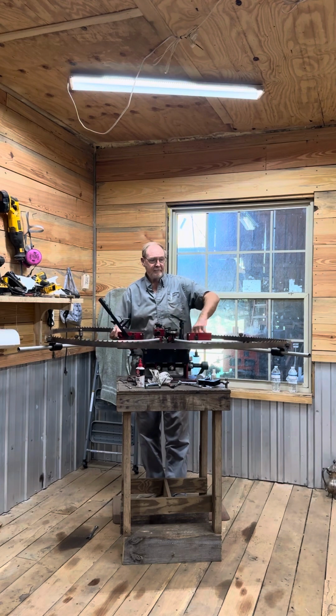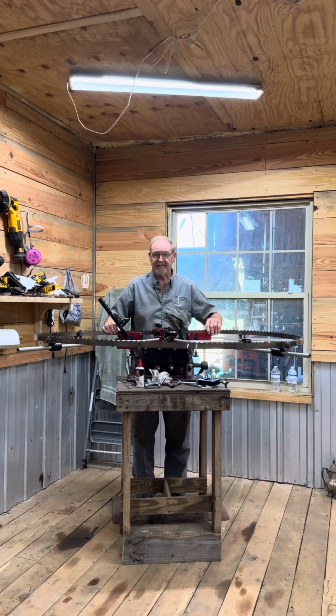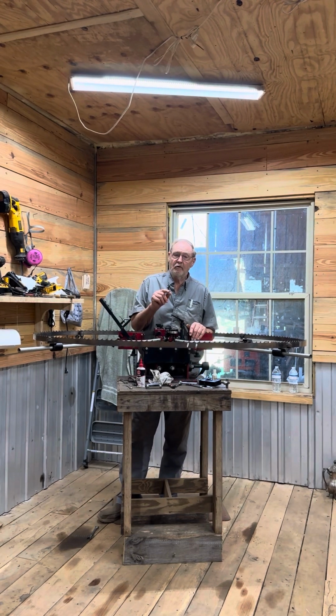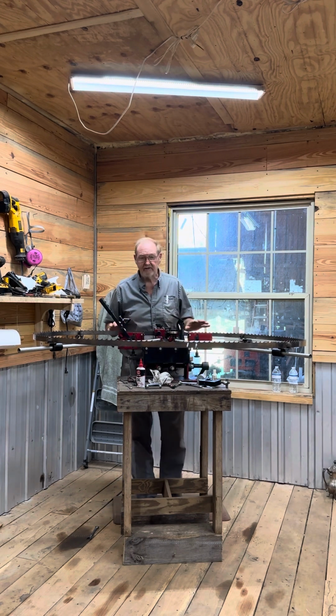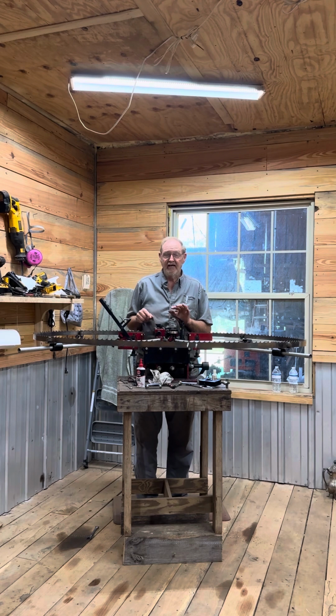and I put the weld joint 180 degrees out from me. I do not start my set at the weld joint. A couple of reasons: whenever that blade is welded together and you grind that off, it's annealed, it's heat treated, so the weld won't break. And for about this far on each side of that weld, that blade is hard, and the teeth don't set just right sometimes. So I like to start around here and get my consistency on my setter. Then when I get to the weld, I will pay particular attention to it, check it for the set, and check to make sure that the teeth are in the right sequence.